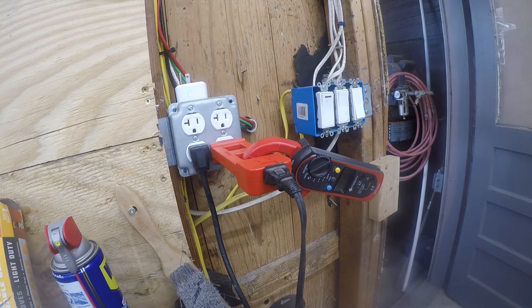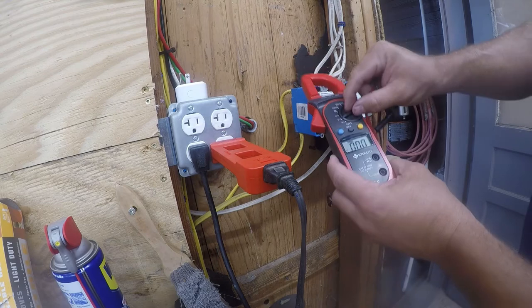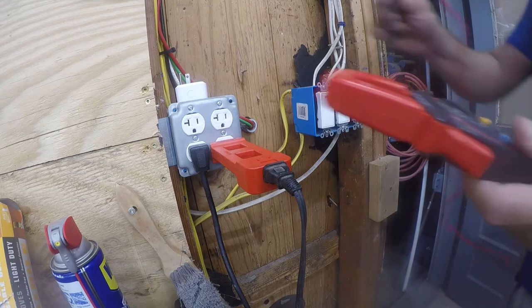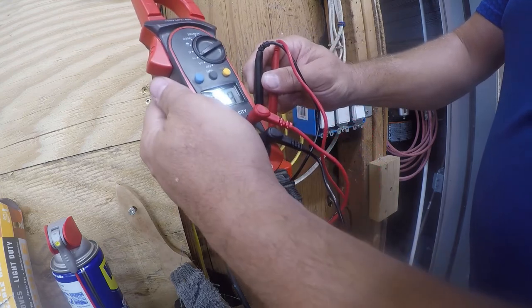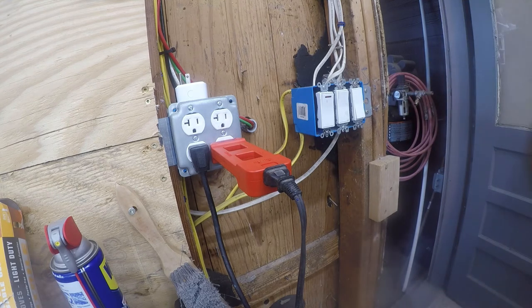Another thing this is good for: if you suspect you don't have good voltage for your device, there's a voltage check function that is somewhat safe. In addition to the AC squiggly-line symbol, it tells you if you're in AC mode. Common is black. You do have to be careful here. We're getting 119.5 volts at the outlet. The meter also comes with probes, which is a nice resource.